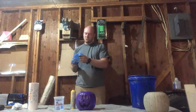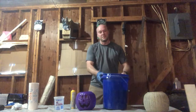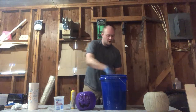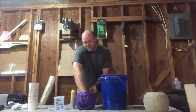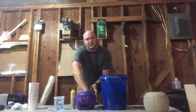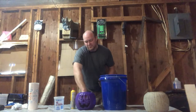Scooping it in. You can choose to use the same scoop that you mixed your concrete with, a shovel, pour it straight from the bucket — do how you want to do it. I'm going to choose to use my hands again, just so I can make sure I work it into the crevices nice and easy. Look around, shake it a little bit — all that vibration is what gets the trapped air to move to the surface and give you a nice smooth finish.